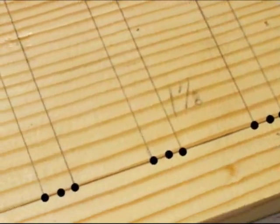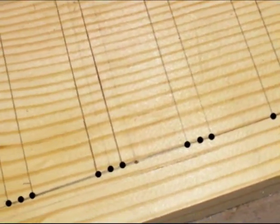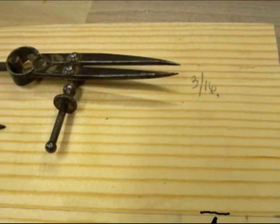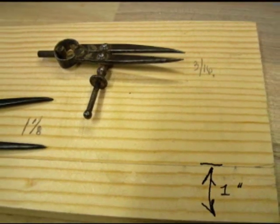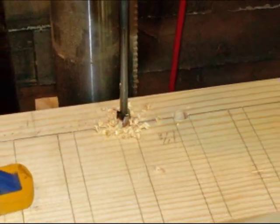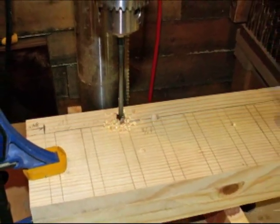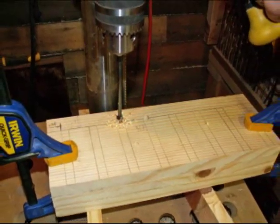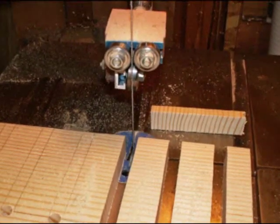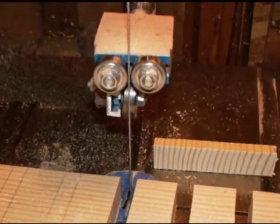The key to the whole project is the little fingers that hold the clamps. You can lay them out with a ruler, but there's a lot to do, so a couple pairs of calipers can make quick work of it. The little holes that the calipers leave are perfect to fit the brad point of your Forstner bit into when you head over to the drill press. While we drilled the holes three at a time, on the bandsaw we cut out the waste one at a time.